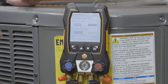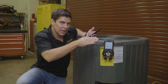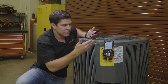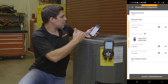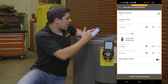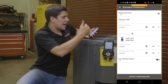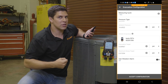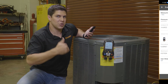My maximum decay target is exactly where I want to start when I want to get to that point. When I get to my decay target, I hit the evacuation target and I want to make sure I'm not going over that — so generally it's 1,000. This is all set up directly from Testo right out of the box. Same with the app — I can do the same exact thing. I can set up my targets, my pressures, and I can also use a vibration alarm once I hit those targets, because evacuations sometimes take a long time — so why not get some work done and be notified once you hit that target.